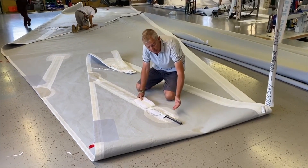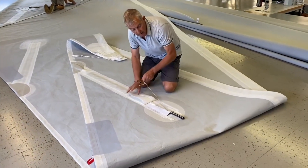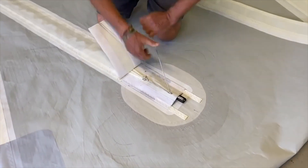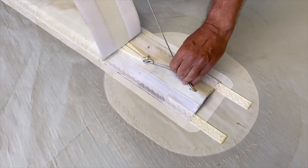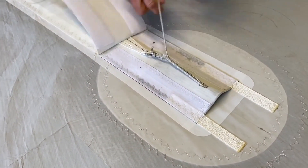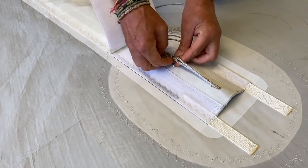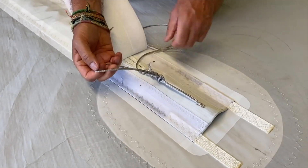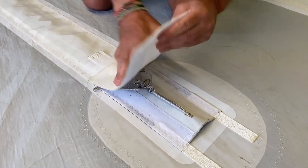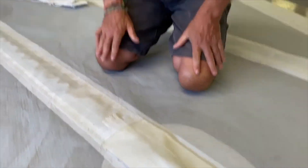Battens are going to load from the bottom of the pocket. We've got a simple lashing system — you're going to be using whole carbon battens and the lashing system works ever so simply. You do it up at the beginning, tension the batten correctly, tie off the Dyneema. Obviously this tail's a bit long but we'll be dealing with that. Then down goes the Velcro — everything neat and shipshape.